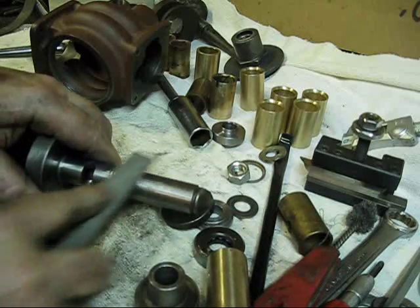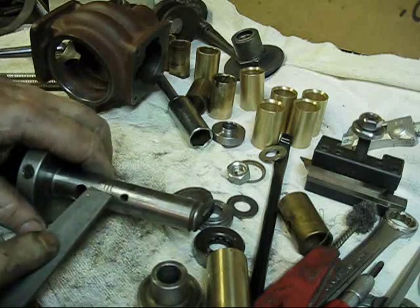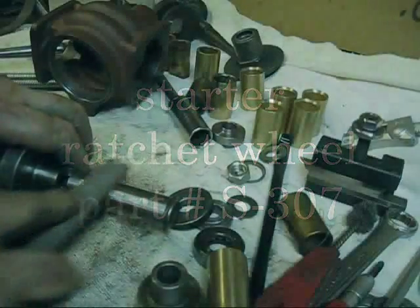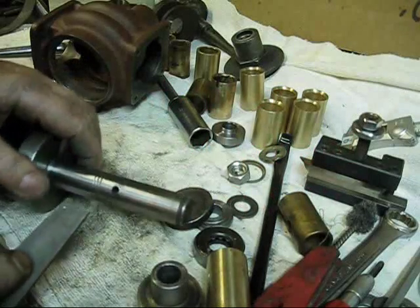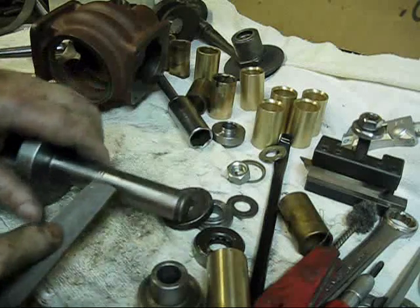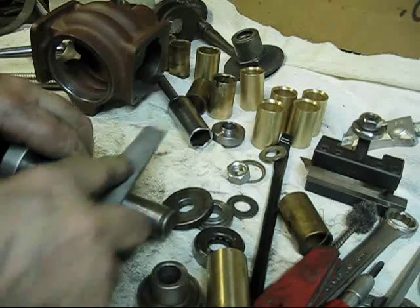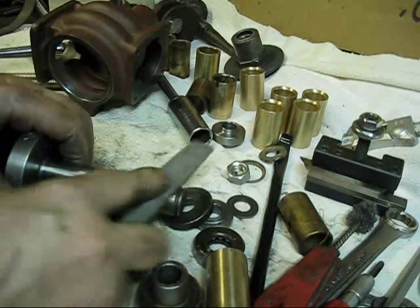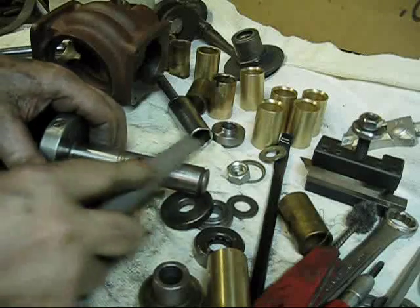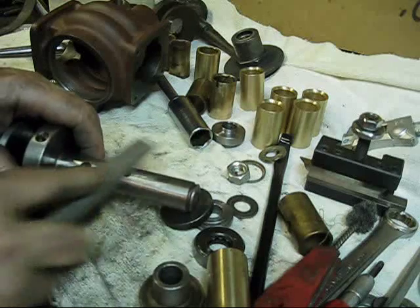That was mushroomed out a little more, and you don't want to get this too much because that's where the kick pedal part with the balls is right in there. I'd rather have a high place than a low place. You can see when you're working with the file right here, when the file goes across it, you can see the removing of the material. Each time you file, you don't want to just file in one place - you want to make a smooth transition wherever the high place was. And this is where those shadow lines will benefit you.